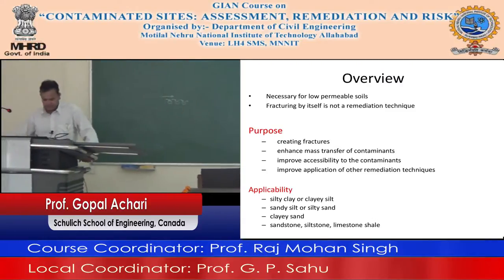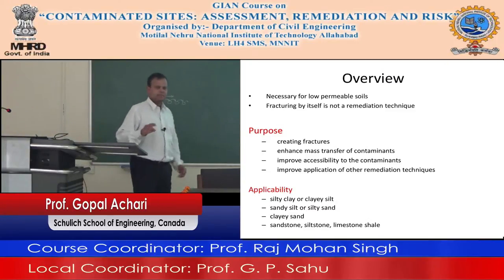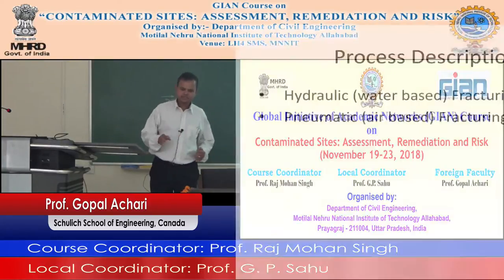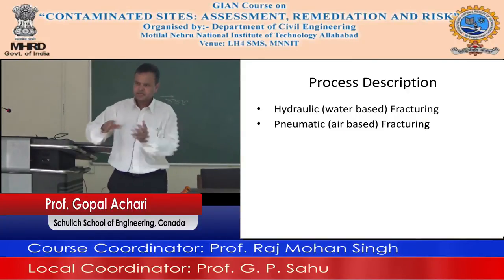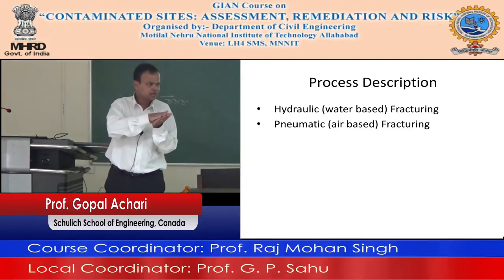Where does it work? It works in silty clay, clay silt, sandy silt, clay sand, sandstone, siltstone, and so on. It can be water based or air based. In air based, we don't use sand. Air based, you just have a big blast of air. What happens is, because the air comes in, it cracks open wherever there is a plane of weakness, it will open it up.